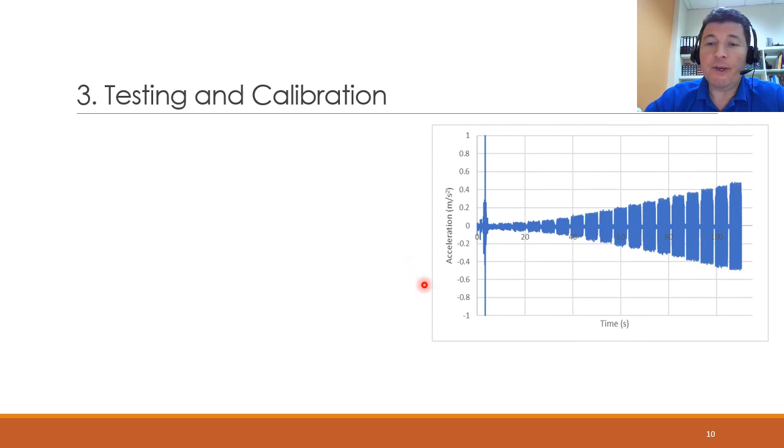To calibrate our instrument, we used an accelerometer incorporated into a smartphone. We positioned the smartphone on top of the nozzle of the instrument and generated the vibrations in order to measure the acceleration of the vibrations, and we used those measured values to calibrate our instrument. So depending on the output generated by the digital potentiometer driving the exciter, we would have a specific acceleration for that value. Here you can see a recording made using the accelerometer where we gradually increase the intensity of the vibrations until the patient presses the patient button, indicating they have felt it.